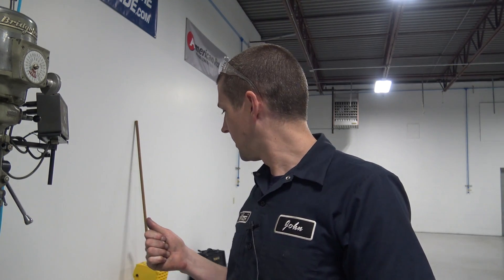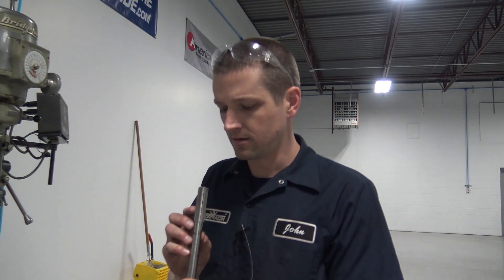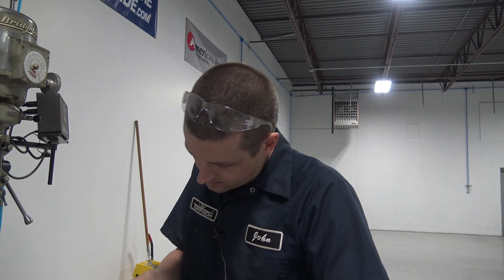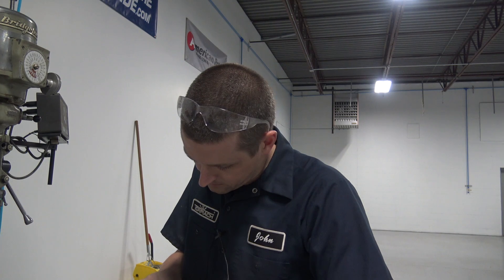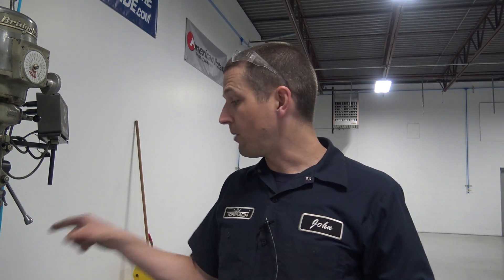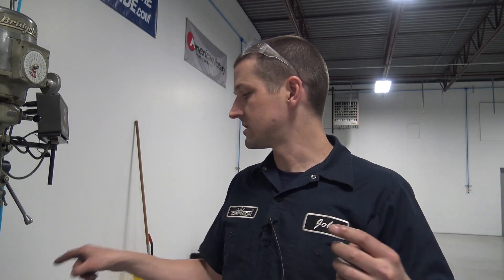Obviously Adam could handle this part himself — it's no big deal for him to take a pilot hole and drill and ream it himself. But that's not how I want to send Adam a part. What do you guys think — should I try this again and leave less stock? Should I try it with a finish end mill? The good news is we over-reamed it, but it didn't seem like using a roughing end mill was a no-go. I actually think this is going to work — we just need to tweak something. Let me know, folks. Thanks.